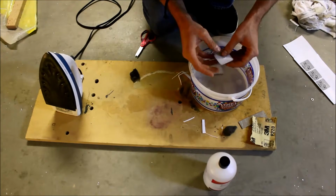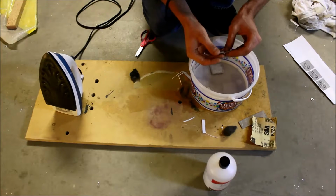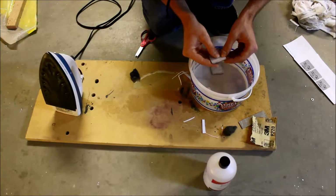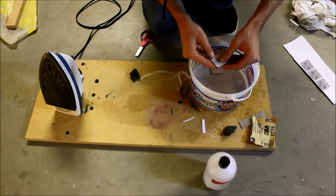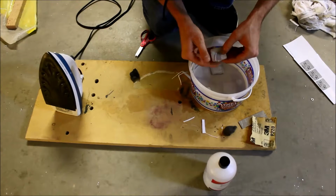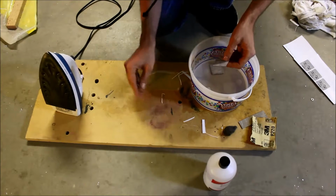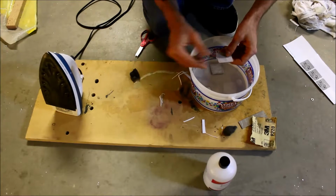Okay, now by now, the first one has been completely, well, this particular paper, there's two layers. It's a glossy paper. So what we do, there's an air bubble in there, which kind of scares me. Oh, but look at that, it's not an issue. So the first layer of paper is usually pretty easy. If you try and pull both the layers of paper off at the same time, you'll just rip the traces off. There's just too much tension there, usually.